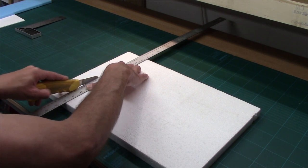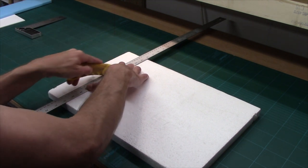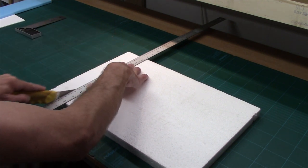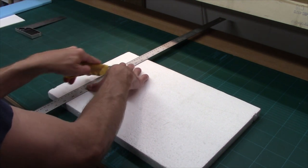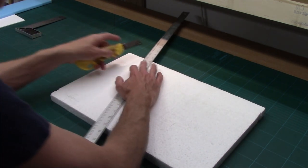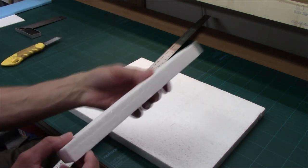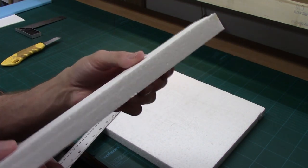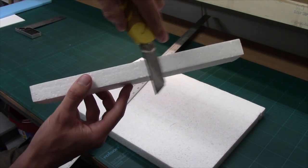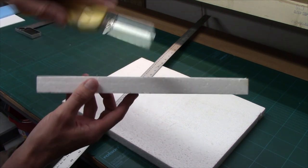It's the dragging that causes it to rip and cause the bobbling. So if you do it nice and gently at a very slight slope, you should end up with a beautiful clean cut with no ripping whatsoever. Remember, the trick to using expanded polystyrene is: if you come in steep, you will drag and rip these bubbles out. If you come in gentle, you will slice through them and get a nice cut.